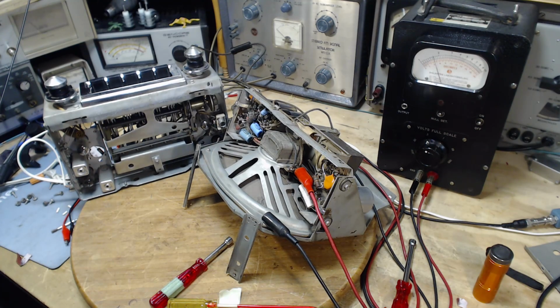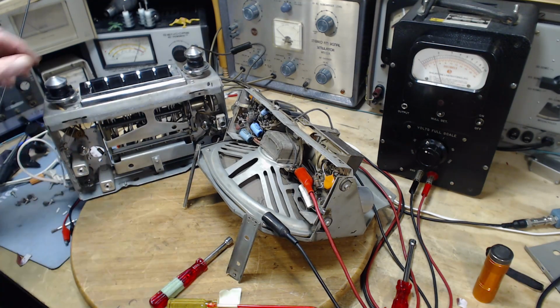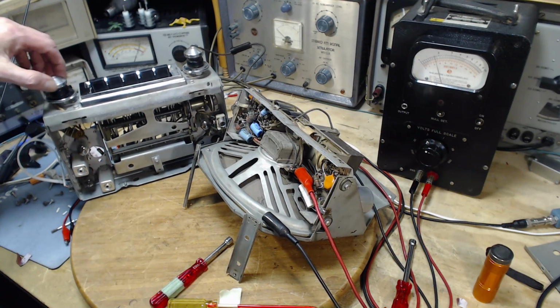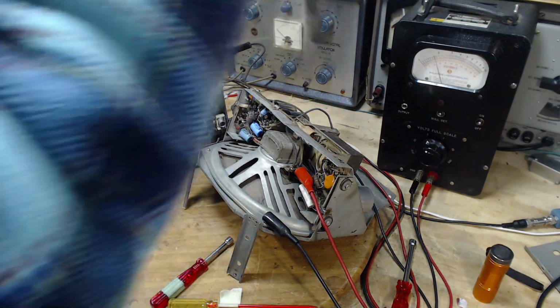What do you prefer? The buzz or the whine? Neither of which can probably be heard when the car's operating. So you've got its volume here. I have to put the antenna back in to find that out. Better do that, because I've switched to two different output tubes now, and the situation could be different.